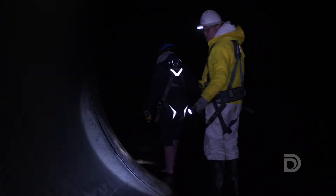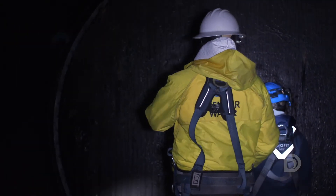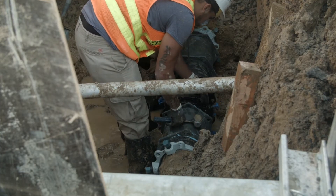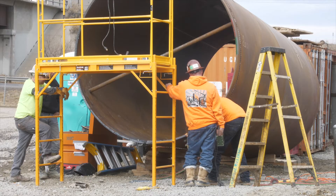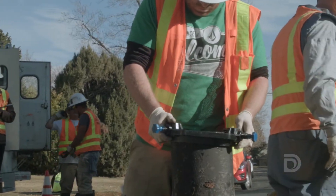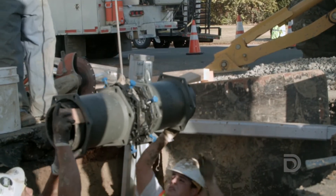Now I realized there was a turn here. The reason we have different diameter pipes in the system is very often not only do we have to supply neighborhoods, but we have to move water long distances across town. We use those larger pipes to move large amounts of water far distances, and within neighborhoods, we use the smaller diameter pipes to actually serve customers in the neighborhood.